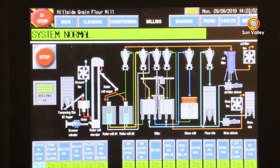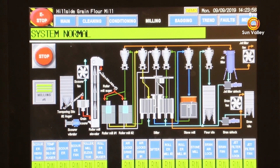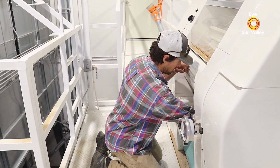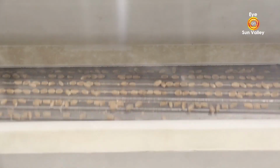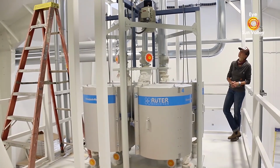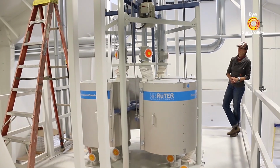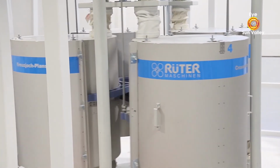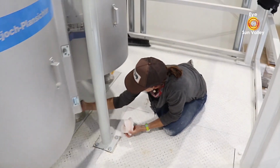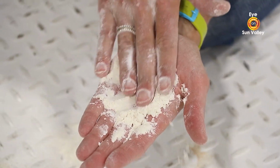From those silos, when we're ready to temper it, it goes over into a tempering silo where we add a little bit of water to get the moisture content to where we want it. Hard red or bread flour, we usually target around 15%. When we hit that percent, usually within 12 hours or so, it goes to the roller mill for the first break. And then, we'll see inside, it does this really fun sort of bobbing back and forth between the roller mill and the sifters, because there's 2 breaks on the roller mill. And then at the bottom of the sifters, it sorts out between a coarse grind, which goes down to the stone mill. What's already made into flour from the first break goes into the flour silos, because you don't want to mill flour twice. And then the bran goes back to the second break on the roller mill.